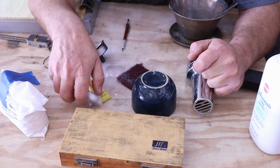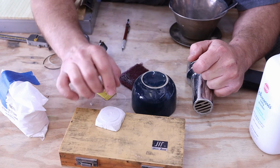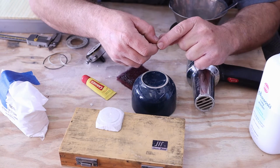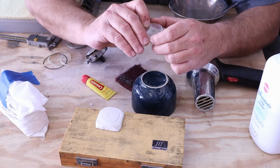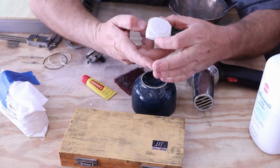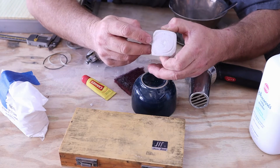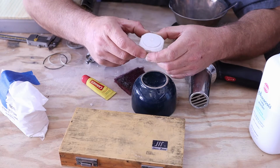Then I removed it, and what I had was a slight dome shape. I had the dome shape, and I also had the edges to trim. Then I set the previous lens on top of that and trimmed around so that I had a fairly close shape. I held it in the lathe, in a 4-jaw chuck, got it close to center where I needed to be, and then just gently turned the outer surface down to the correct diameter. I got it close enough.